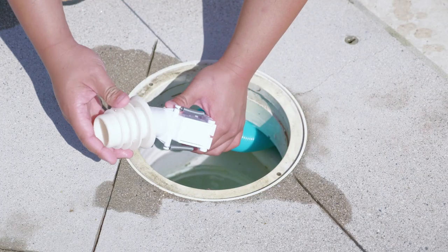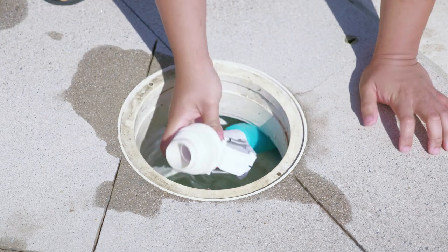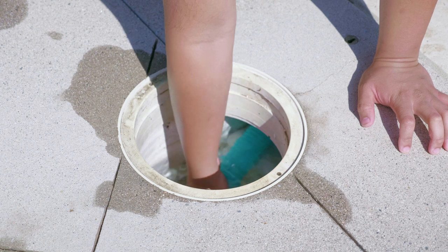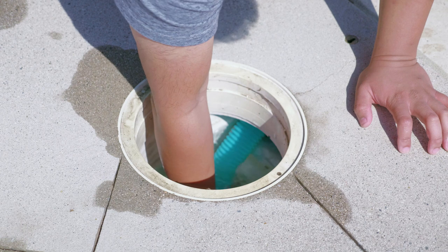In order to insert it into the skimmer, you want to attach the hose cone adapter on the end — this is required for this assembly either way. Remove the skimmer cover and basket and feed the hose on the skimmer port on the pool where the water pulls in. Insert the cleaner into the piping inside the skimmer.